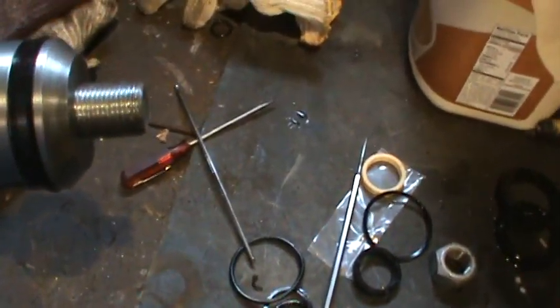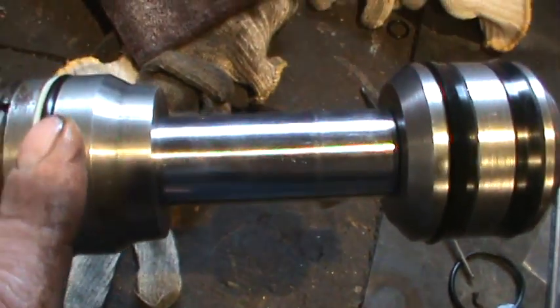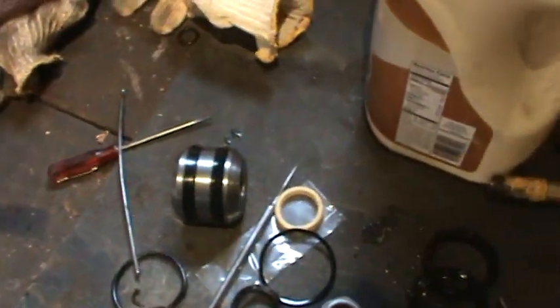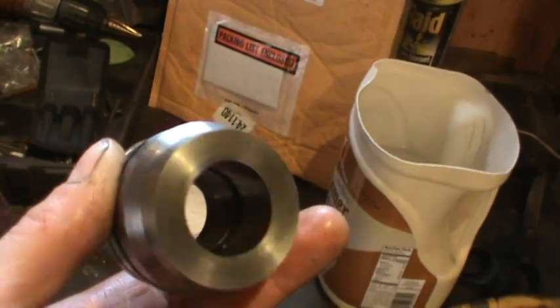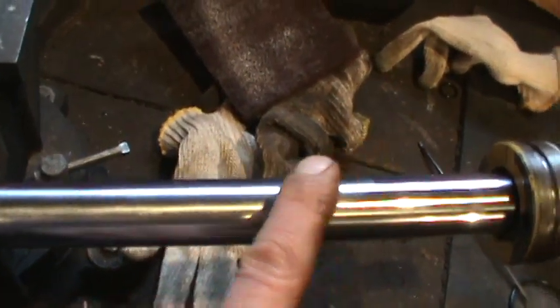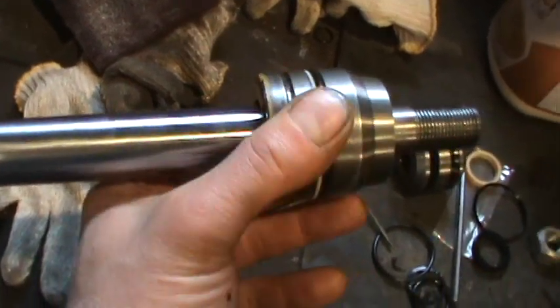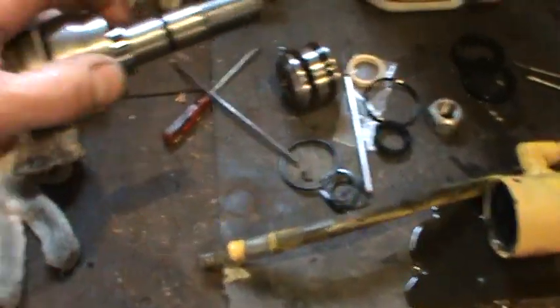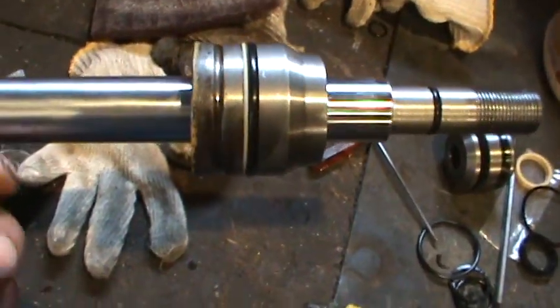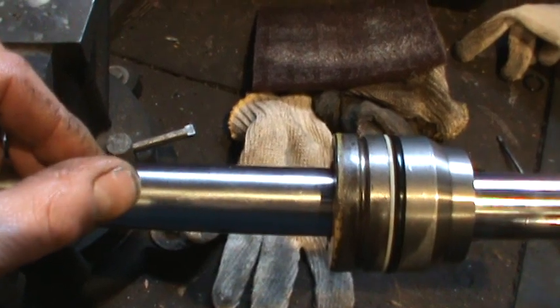This is what's inside — two pieces. This is the piece that the cylinder slides to and fro on; it has a seal on the outside. There's a sweep on that edge and then another seal on the inside. Inspect your cylinder for any nicks or scratches — if you can feel anything with a finger you want to knock that down, because that's what's going to beat up the rubber seal going back and forth. This exposed area is usually where you see damage. I use scotch brite and some chain lube — there was a little nick in one spot you could feel going over it. You just want to knock down anything sitting proud.